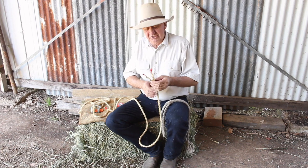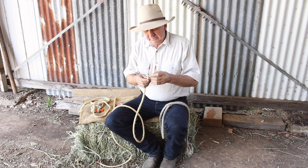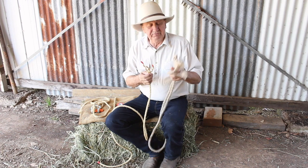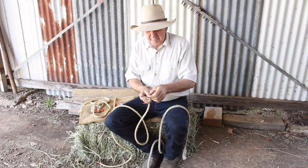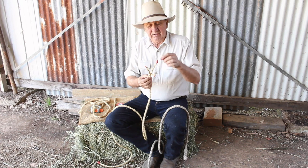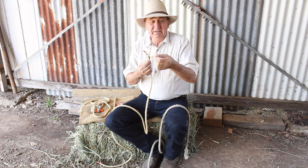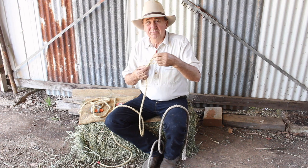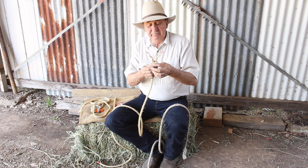What I've got here just to show is a new piece of hemp rope. This is going to splice back on itself, just like this end here. I'll open it up about 10 to 15 centimetres. I've tied and taped the ends with a bit of electrical tape. If you've got nylon rope, it's easier to use a flame to seal it off. With hemp rope, I find electrical tape is perfect.